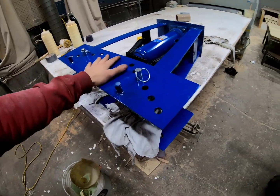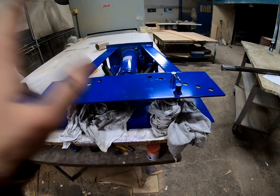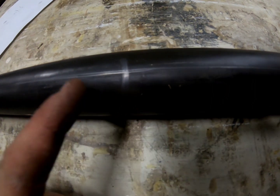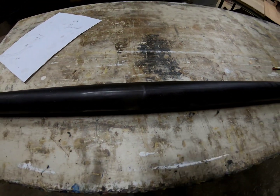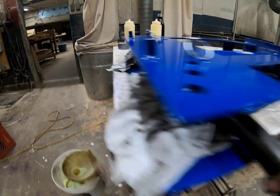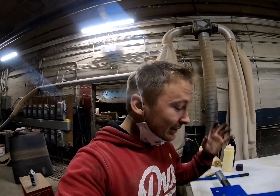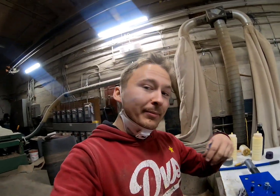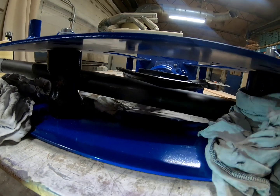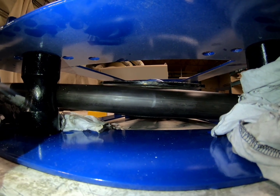I always lay mine flat on a level surface — I've leveled this table out to be perfectly level so when my piece is in it's level as well. Before you put it in you have to mark where the center of your bend needs to be. I'm going to be putting my mark towards my left. There's my line. We're going to be doing this in steps so it doesn't kink. This is a hydraulic press so it can be relieved and pressurized very easily. That mark has to be the center of the actual bend.